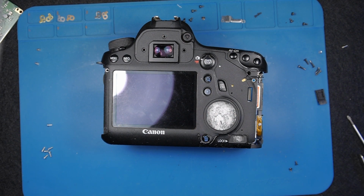Okay, so one last thing, before I close this video, I had a look online to see what the errors are. The error 06, apparently it has to do with the cleaning of the sensor. So dislodging dust from the sensor is not possible. So definitely there's some issue over there. It's quite strange that we get this kind of message. Usually the electronics for that are fairly simple, so that might be the case of a damaged motherboard. And the second error, error 20, is due to a mechanical failure, in this case the shutter unit. So we'll see how it goes, but we'll stop here for now.